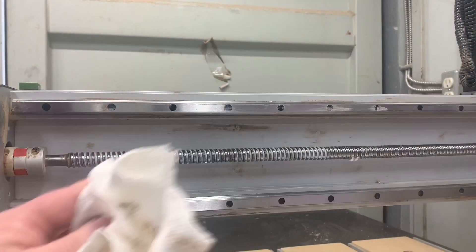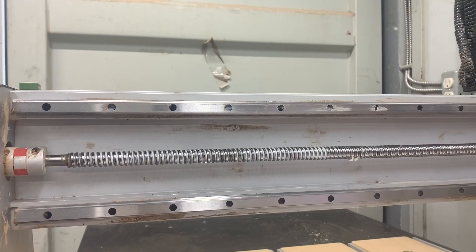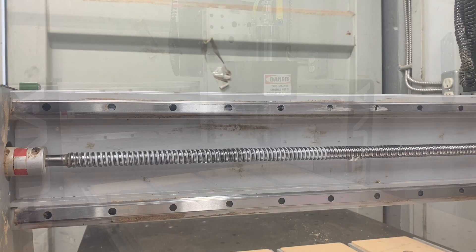I'll do that again — bring it back, clean that side and lube that side. Underneath is extremely tight so you've got to be careful with your hands up under there; you don't want a pinch point. As small as these machines are, there's a lot of power in there. That's about all we can do to lube the ball screws, nuts, and linear bearings on the IQ.